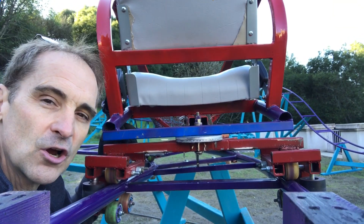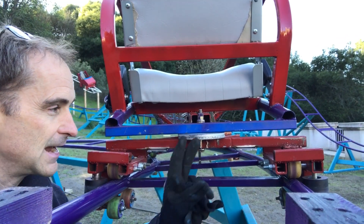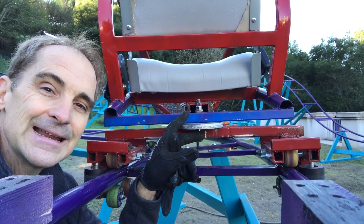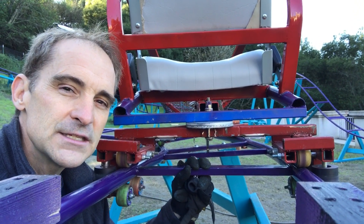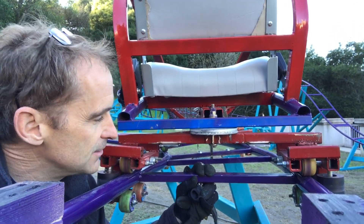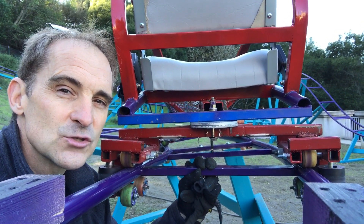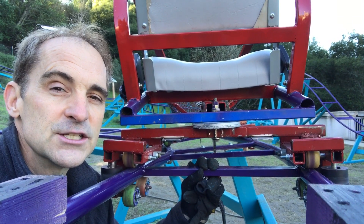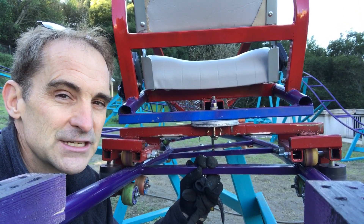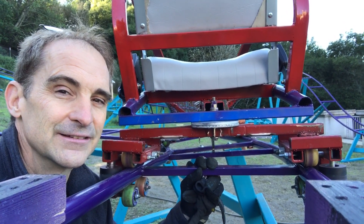This should be pretty tight because this is what keeps the cart stable on the track — what keeps the cart perpendicular to the track — so this needs to be really tight and it isn't. I started thinking this had to do with the cart going really fast and excessive g-forces, but this roller coaster is crazy smooth. It doesn't have a lot of excess force, over-banking, or unnecessary lateral forces going on.